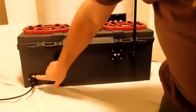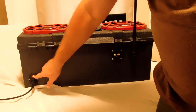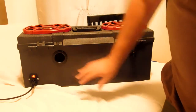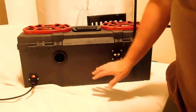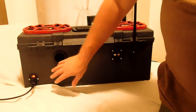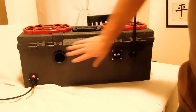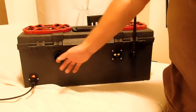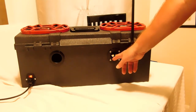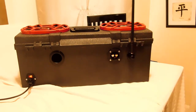So you can see right here we have a master switch. There's actually a fuse inside this switch where the cord plugs in, and this switch turns on and off the power supply. We have this port tube here — it's doing two functions. Number one, it's porting the box a little bit, but also there's a lot of things in this box giving off heat: the voltage booster, the power supply, and the amplifier. The fan is at an angle blowing the air back, and all that heat needs to come out of the box. Right here is our connection where we charge the battery — you clamp your battery charger right here. And of course, we have the antenna.